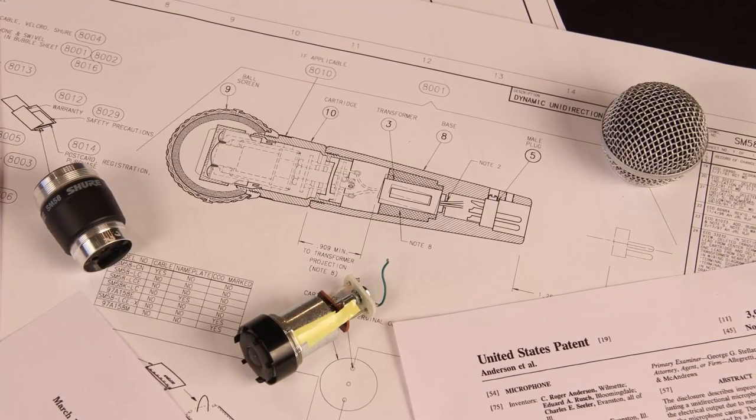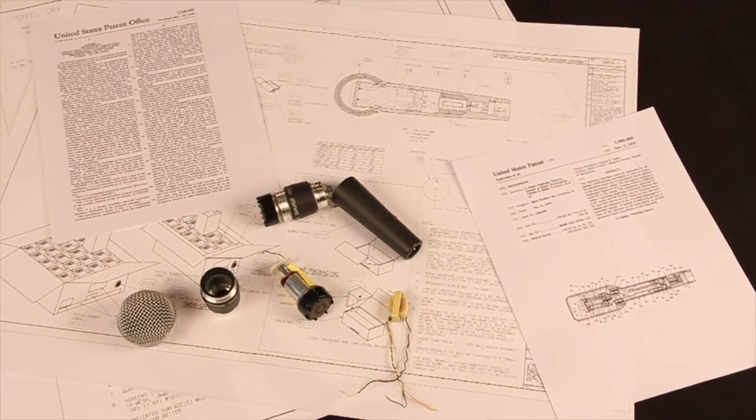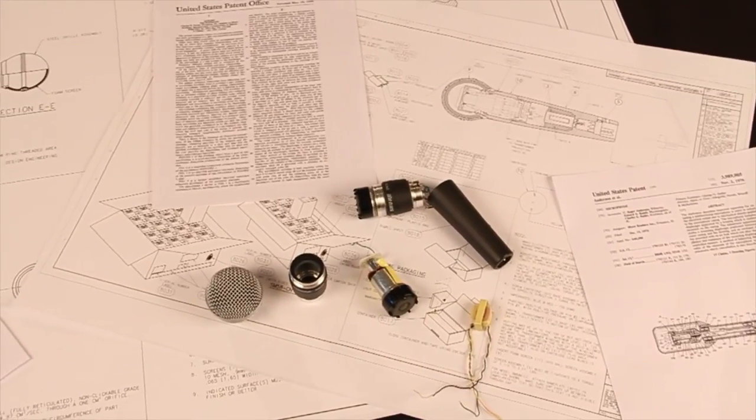If the Unidyne established the basics of how a directional microphone works, what did the SM58 add to the mix when it came to the market? Well, a dynamic microphone — for it to work, part of it has to move. The diaphragm and the coil need to move. So if there's any mechanical stimulus introduced to that microphone system, the diaphragm is going to move and create some sound. You've heard handling noise, rubbing, rumble come up the stand and be transmitted through the microphone. In the 60s, Shure solved that with the introduction of the pneumatic shock mount, which is a very sophisticated system that hasn't been duplicated by any other competitor to this point.